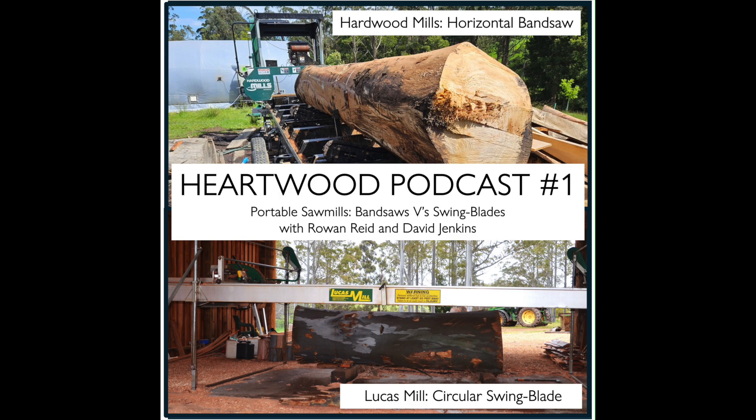Debarking makes a huge difference and it isn't easy. Bark comes off eucalypts very easily if the tree is actively growing — in a good wet autumn or warm spring it's almost dangerous; the log can slide around. The problem is that dragging logs across the farm picks up dirt, sand, and rock. It's not worth hitting those with a blade. Best to get logs with bark onto the mill site and then rip the bark off there, even though it's a nuisance. The Lucas mill handles bark better than the bandsaw.